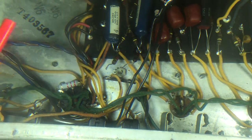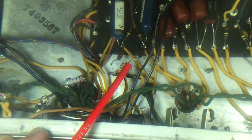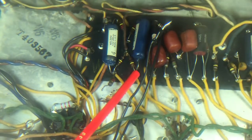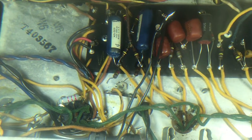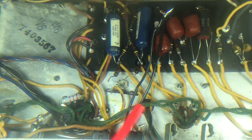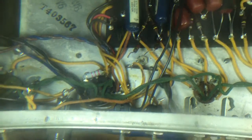Additionally, to make this more like the AA864 circuit, I removed these 220k ohm resistors that were coming back to the plates of the power tubes. These were feedback resistors to the plates, and from what I've read they're real tone saps — they kill a lot of that old classic blackface interactive tone.